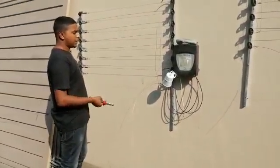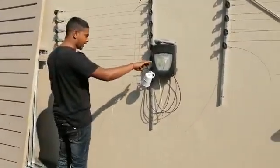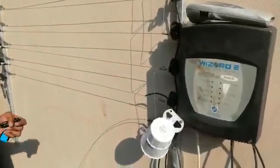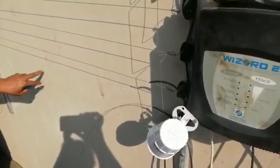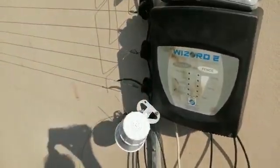I'm now going to show you that the fence is still connected by trying to trigger it from another location. This is the most unlikely place someone would try to enter — where the loops are — because they would normally try to gain entry from the center. Triggering it from here should activate the siren, and as you can see, only at this loop point does it trigger.